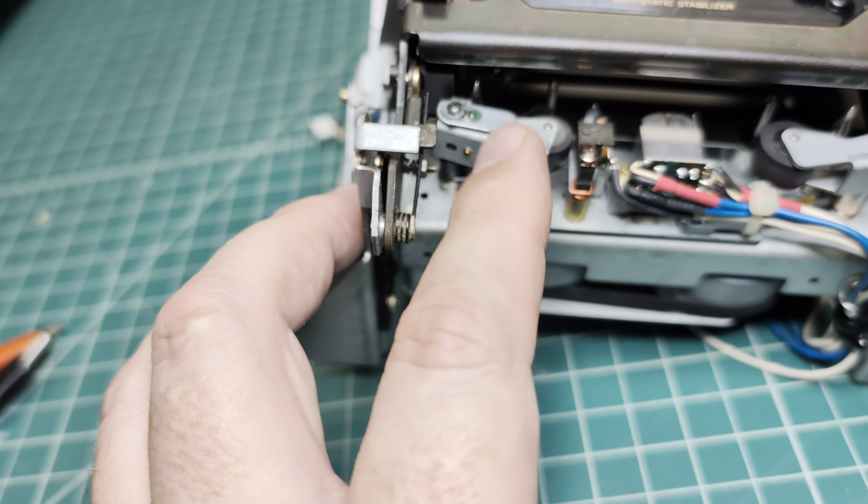I don't like it. I've already done everything I know for the Sankyo. I believe the capstans are not balanced — that's the root cause. And if the capstans are not balanced, that's the maximum I can do. Over time maybe something will change, but that's what we have.